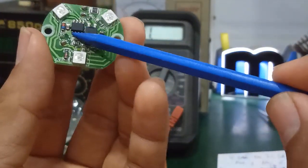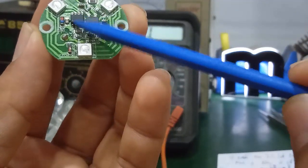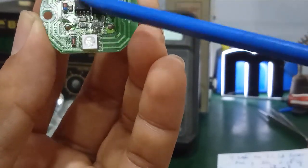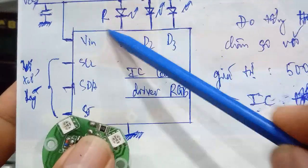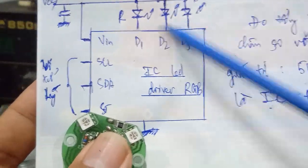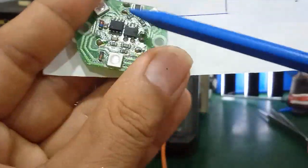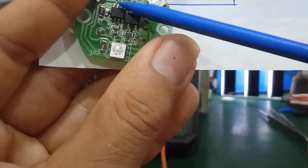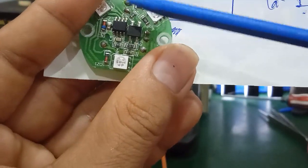If you measure a value that is too high or too low, the IC has a problem — replace it. For example, if no color is output at all, or one color is missing: measure the voltage on pin D1, D2 while live. If all pins have voltage but one color output pin is missing voltage, the IC is dead. That is the hot-test method. The next video will cover the hot-test method for this IC in detail. This video covers the cold-test method to quickly determine whether the IC is alive or dead.